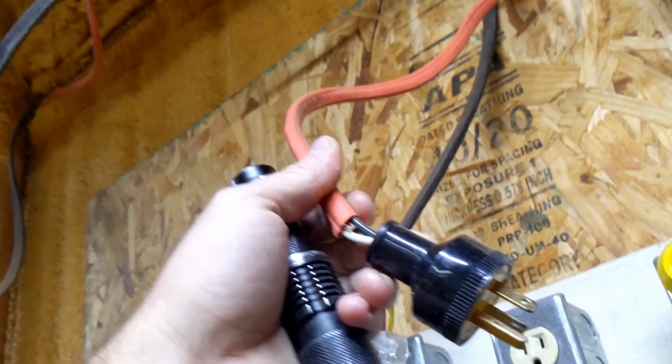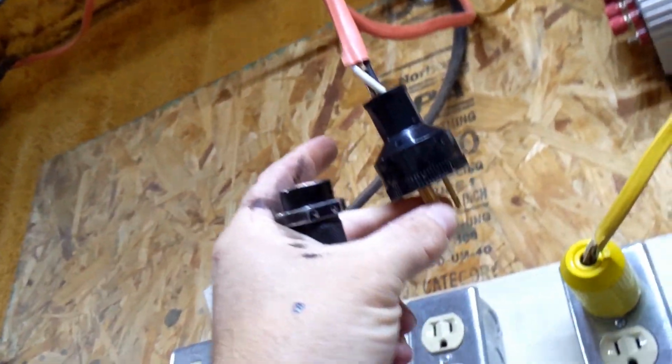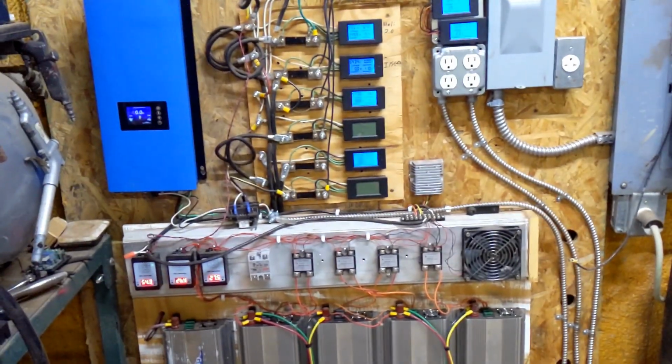And getting up here and actually checking, that's our circuit for the i2000, and it is a dead short between those two leads. What I'm thinking is, I don't know if this will show up on the video very well, but right there, about 2 foot underneath the turbine itself, there's a little bundle. That's my junction. That's where everything ties in, and I'm willing to bet that it's damaged and my short's there, but it's got to come down and get worked on. I'm going to try to do that sometime this coming week.